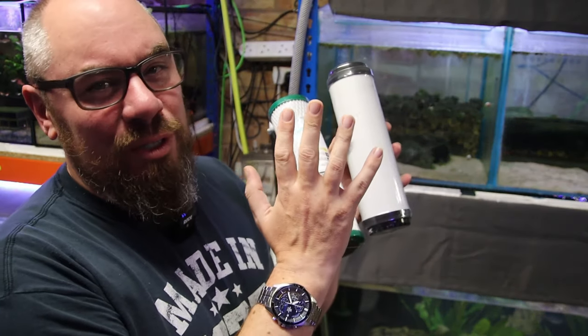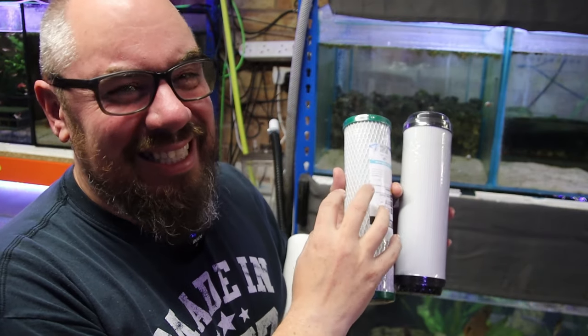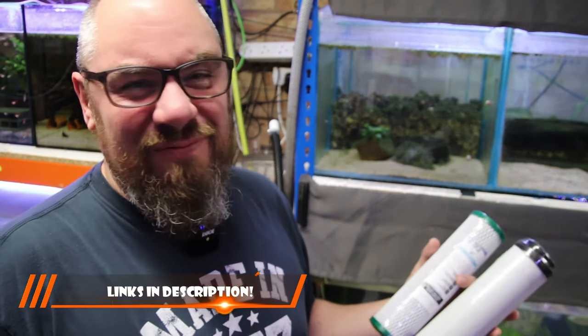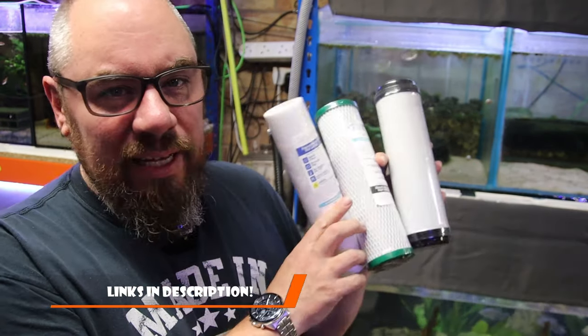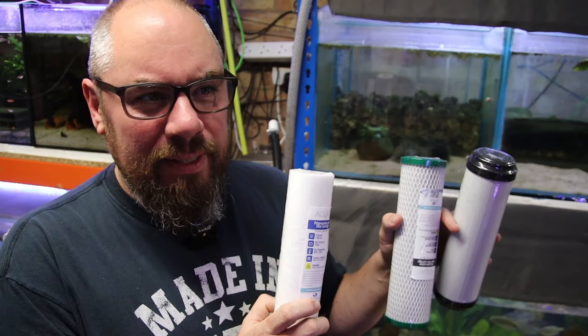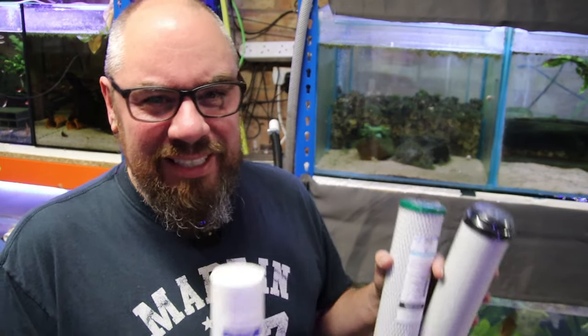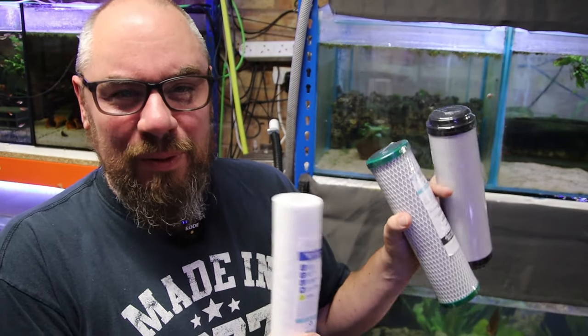Some people run two carbon blocks, some people run two carbon granules. Some people run various different types, sizes and specifications of carbon to remove more or less depending on their use case. But in general, if you go on — I'll put some links in the description — Amazon or eBay looking for an HMA filter, it will fit 90% of your needs just going with the standard stuff. Flow rates is the next consideration. These are the 10-inch cartridges; you can get 20-inch cartridges and all kinds these days. Cartridge size matters because flow rates are quite important with HMA filters — some are rated for 4 litres per minute, 10 litres per minute, 20 litres — depending on the size of the cartridge. You can't run it at full blast expecting to remove all the chlorine or chloramines unless you have the cartridges rated for that flow rate. But in my fish room, the flow rates I get are more than enough to do nice leisurely water changes.